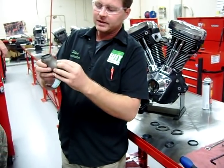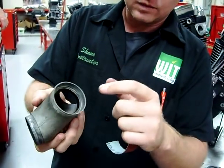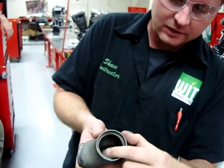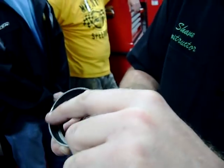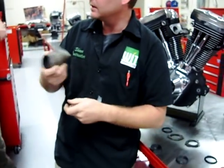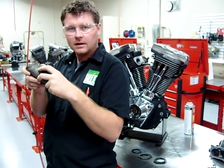The other thing that I've seen to be a big problem is around here — do you notice how on this manifold that's not even machined? That's actually still the rough casting, and we're casted on the inside as well. We have a stopping point where it's casted but it's not finely machined. Do you see that burr right there? There's a lip on there — knock that off. That's just a casting burr. What do you think that's doing to the O-ring? It's pushing it up and creating a high spot so I don't have as much real estate or seal on that.